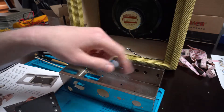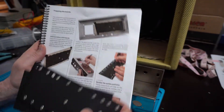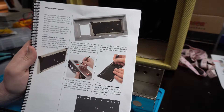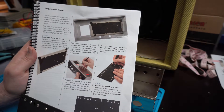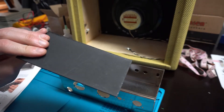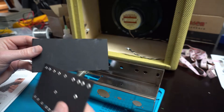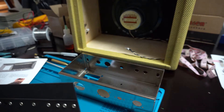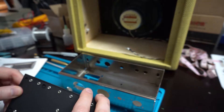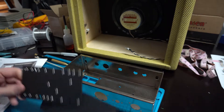Mounting the outside pieces - on this first part we're going to prep the circuit board. We'll tape them together, mark out some holes, and then drill some holes to get ready to mount in the chassis. The first step: we've got the two boards. This is the backing board - it goes in the back to prevent the components that'll eventually get mounted to the front from grounding out to the chassis. As you see, there's no holes, so according to instructions we have to tape them together, which allows us to mark out the holes both on the board and also inside the chassis to drill the holes through the back.